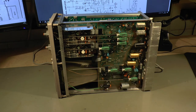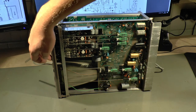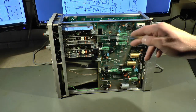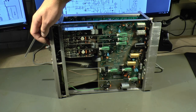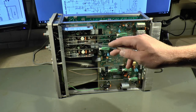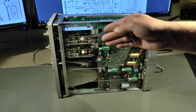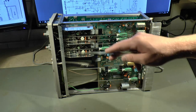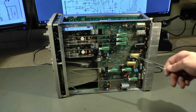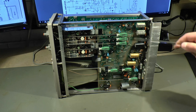Taking a quick look at the construction of the scope — we're now looking at the underside. They're using switch extensions so all of the front panel switches actually operate some switches further behind the front panel, extended with these bent rods, which always makes the front panel switches feel so nice. We can also see the two front-end amplifiers — fully discrete amplifiers with socketed metal-can transistor packages. These might be JFETs or matched transistor pairs, not sure — they have six pins.